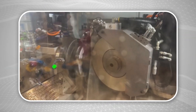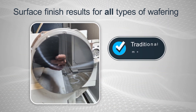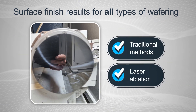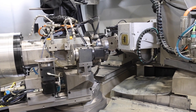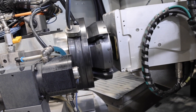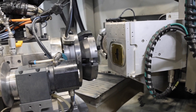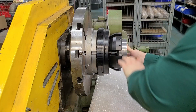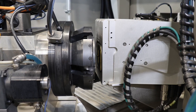The Boule Pro grinding process can be tailored to produce surface finish results for all types of wafering, including traditional methods as well as laser ablation wafering. The orientation correction is important to support downstream processing steps such as epitaxial growth. Additionally, the Boule Pro can orient the puck more accurately than traditional methods, due to the high level of precision in how the material is held during the surface correction grinding process.